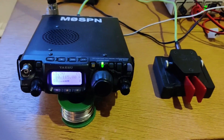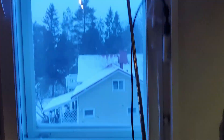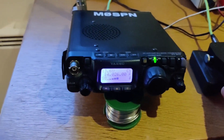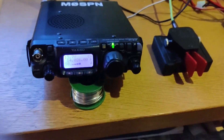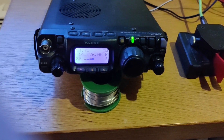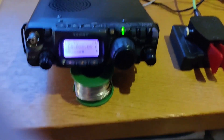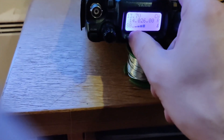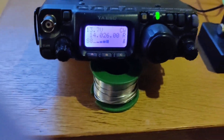Let's try and go slightly higher in frequency to where the antenna is probably a little bit more effective. I'll tune this up for 20 meters. So I'm back on 20 meters. The antenna is about 90 centimeters long, which is a bit better. I'm no longer getting shocks off the key, although I am getting static shocks just because the air is so dry. I've had a few big static zaps, which has been fun. I've checked on the main antenna that there's no activity on this specific frequency. I'm on five watts, SWR is good.